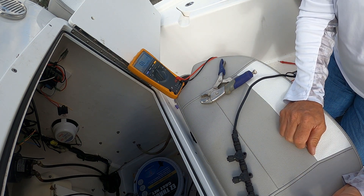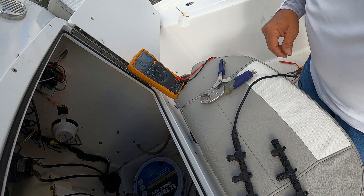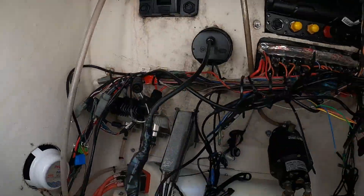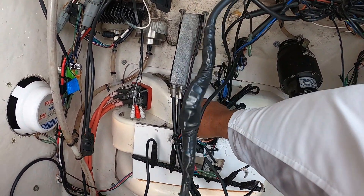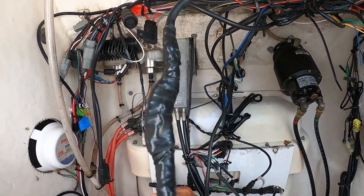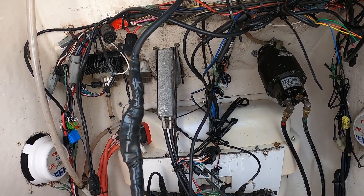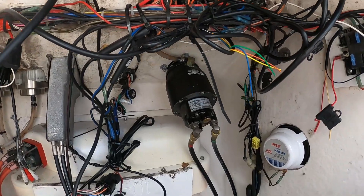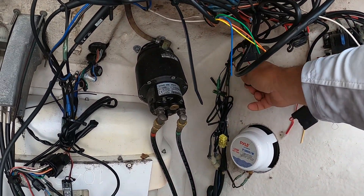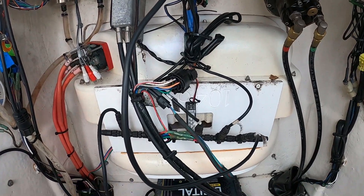I'm going to plug in the second half and see what I've got. I have my fuel sensor, power engine, key switch, and my C10 gauge — which I don't know if it works or not because it wasn't working before. This is the one I took apart and cleaned out the pins. I haven't secured it yet because I need to put in the fuses — I've got an inline fuse to the terminal board and a fuse for the switch leg. I'll put those in, and if it works I'll secure it and call it a day.